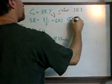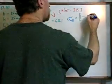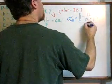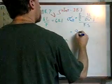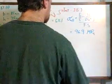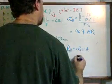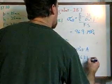In which case, our allowable stress is equal to 1 minus the slenderness ratio squared over 2 times the column constant squared, all times the yield stress, all divided by the factor of safety. When that's taken into account, we end up with 96.9 megapascals — that's our allowable stress. Multiply that by the area for our allowable force, area simply being b times h, and we get 36.3 kilonewtons.